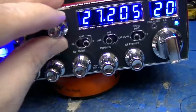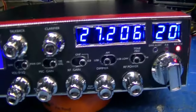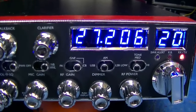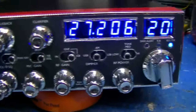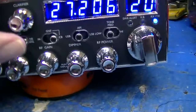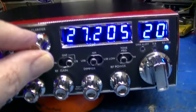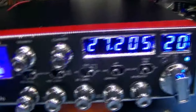What I mean by that — let's go up one KC. When we're in transmit, you notice it didn't go back to the five. That's because your clarifier is unlocked. So you'll be on the same frequency as anybody you're talking to. Very slightly off frequency, you can tune them right in and they'll be able to hear you perfectly.